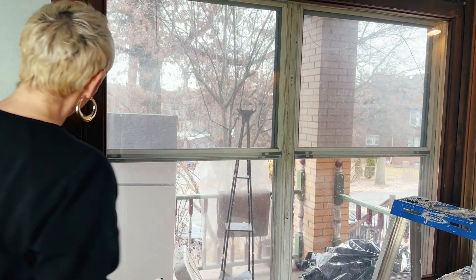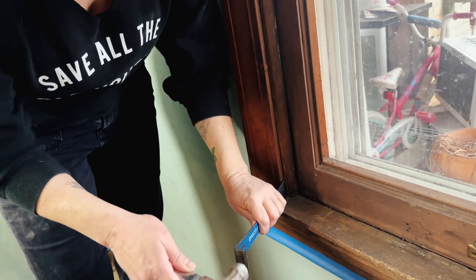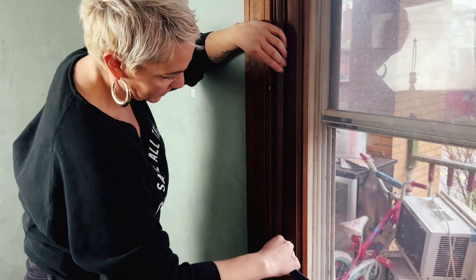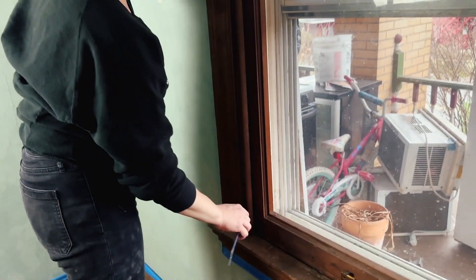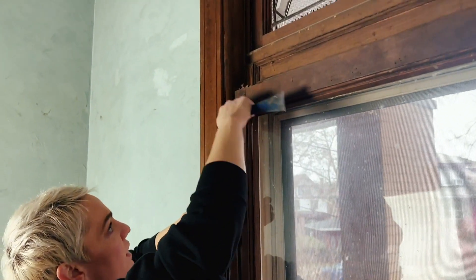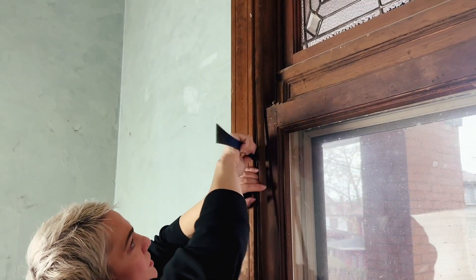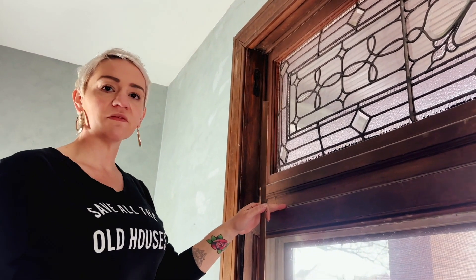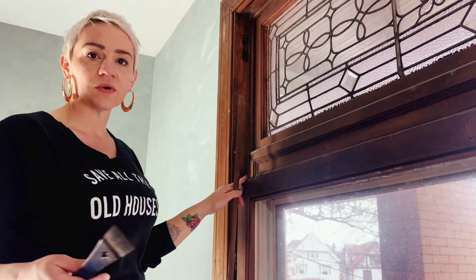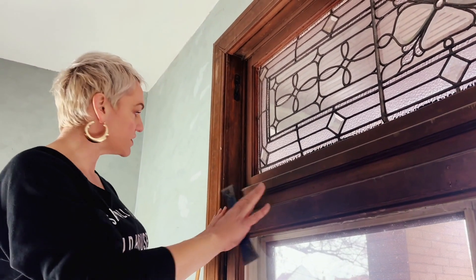So what we need to do first is pop this guy off. I usually like to look for an area where there's already maybe a little room and just put it in there. I'm taking out this trim, which helps keep the window in place. So when you pop this out, the window will be able to move freely in and out. Usually you like to try and do it right next to where you can see there's a nail, because when you do it right in the middle, that's when it wants to break. You do want to be careful when you're taking this out because sometimes the window will be very eager to pop out. It's usually best to work with a partner — someone spotting the window, making sure it stays in place. We're lucky here because this window has a little lock on top, so it's locked in place.